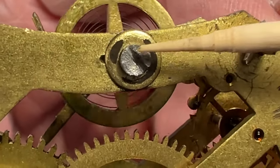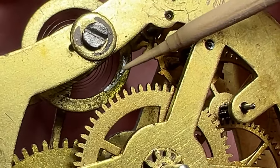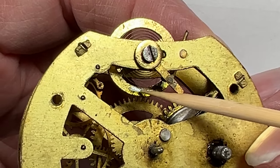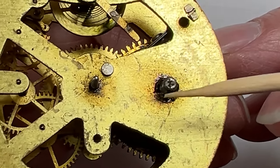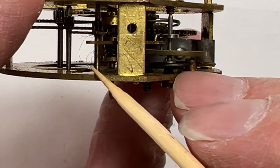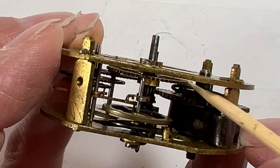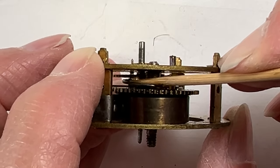This cup bearing screw head has two damaged areas — looks like someone grabbed it with a pair of pliers. The balance wheel rim has hardened oil deposits on it. Someone has over-oiled the movement at one time; the other side has too much oil as well. The oil is old and has thickened to a grease — this black gunk could use a good cleaning. The balance wheel isn't running true. There's a hair wound around the escape wheel, somewhere on the pivots; it'll never keep time like this, let alone keep running for long. This click spring is contacting the center wheel gear teeth, causing friction on the center wheel, which is one of the reasons these stop working.